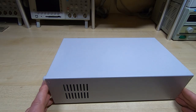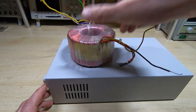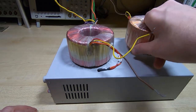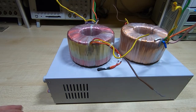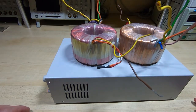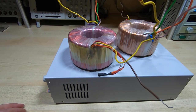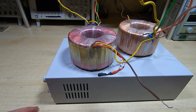It's not very wide, but it's quite a deep case. I do have quite a lot of old transformers lying around — I've rewound hundreds over the years and tend to wind most of my own. I had a couple of 225 VA transformers sitting around from a previous project. I've got quite a few, but these are the two I've picked. They're actually identical transformers — ignore the different colour wire, that's just what I had at the time. They are the ideal size for this case and leave plenty of space for smoothing caps.